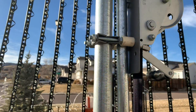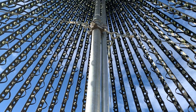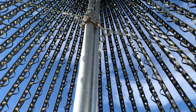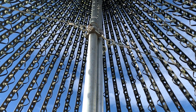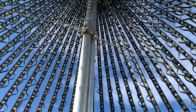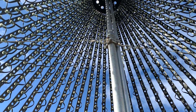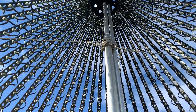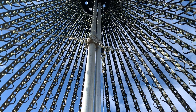I'll point out my guy wire system — it's based on the muffler clamp design. I have three eye hooks: two are part of what attaches the muffler clamps to each other, and one loose one on the end held by a small bolt in the muffler clamp. I do have a design document for that which has been circulated in the xLights group and the Think Tank — if you search for 'mega tree ASAP pole guy wire setup' you should be able to find the PDF.